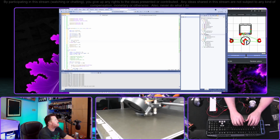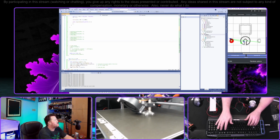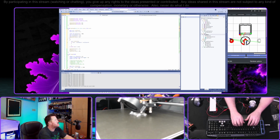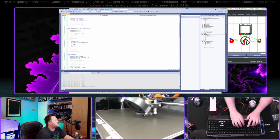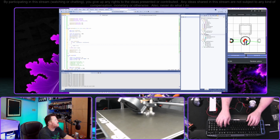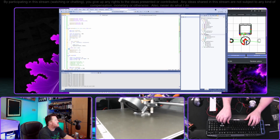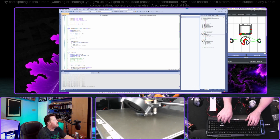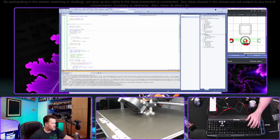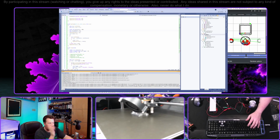So if now minus the last switch time is greater than, let's make this a constant, greater than note count, now we want to switch state again. We need to know what state we're in. We're doing poor man's PWM right now. Switch state, digital write in this state, and then whenever we break out of this, there. See if that works. If I want to do this with speed, I may need to get an electronic speed controller, an ESC. I'll go look to see how much those are, because there's a chip that'll just do this for us.